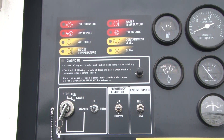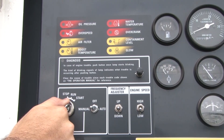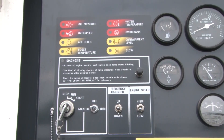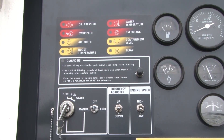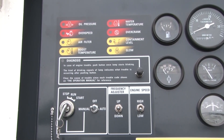When this time has expired, turn the key to the start position to see if the unit is sufficiently primed for startup. This attempt could require a few crank cycles. If repeated crank cycles are required, crank the starter for 10 seconds and then wait 10 seconds to protect the starter before you crank again. The electric fuel pump allows for the ease of priming without having to disconnect fuel injector lines.